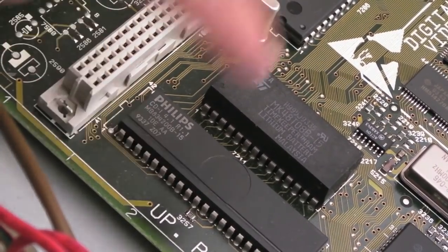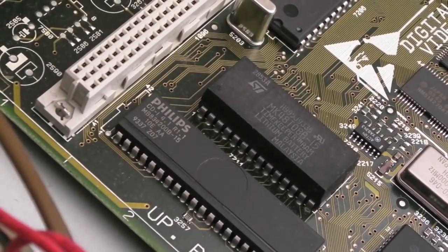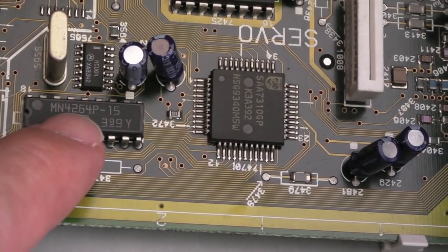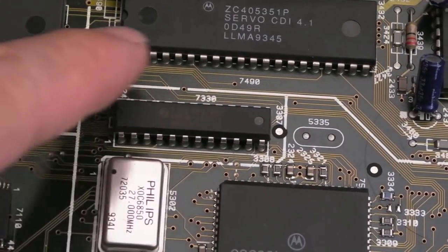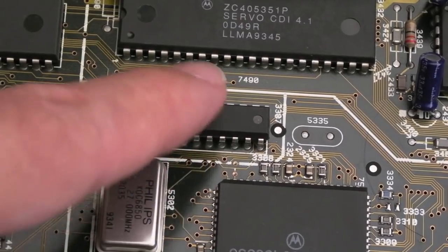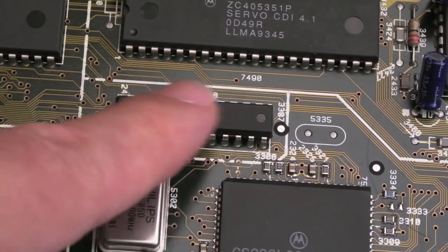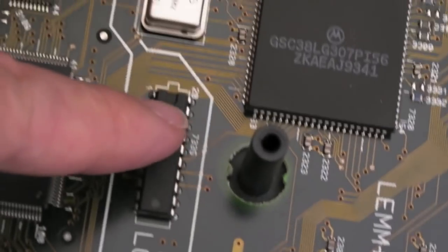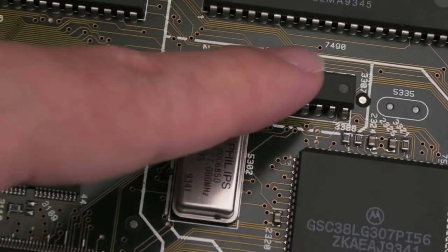Looking a little bit closer at that one — I think that's a ROM right next to the CPU. That contains your bootstrap stuff, your OS, if you like, for the system. And then we've got a 4264 DRAM down here. I think that's a RAM as well, but it might not be — it could be a PAL or something. Just from the part number it kind of looks like a RAM to me — it's got speed dash 15. It could be more glue logic. This says it's glue logic here, actually — can you see the boundary there goes all the way around that? I think that's like a PAL or a GAL or something.